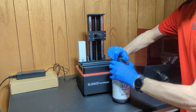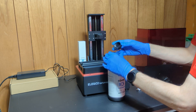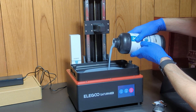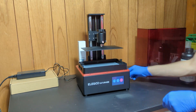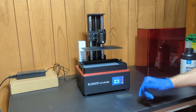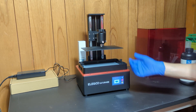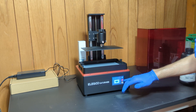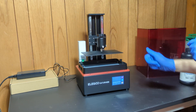Once we have a good exposure setting, then we can print something cool. Look at that cool gray color. We can start our jump drive, go to print, and it's going to be this exposure test. This is called their XP Finder — it's free to download on their website; that's Frozen 3D. You can find your own or make your own. The light turned on — this doesn't actually activate until the machine starts printing.